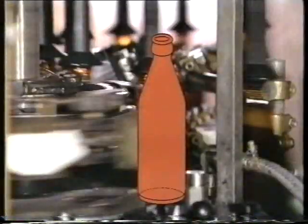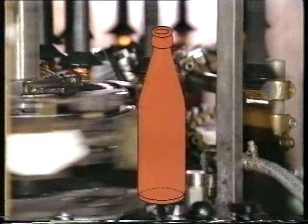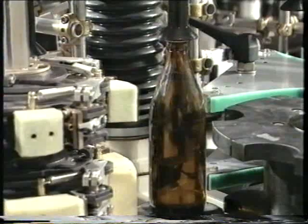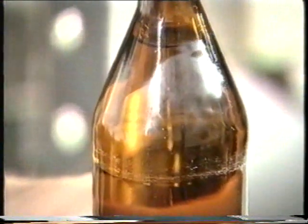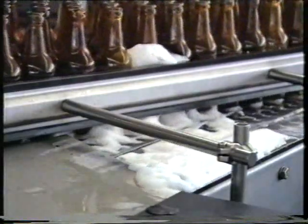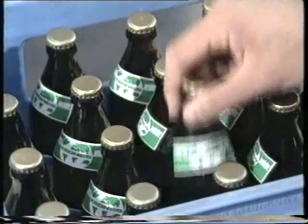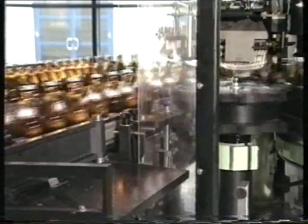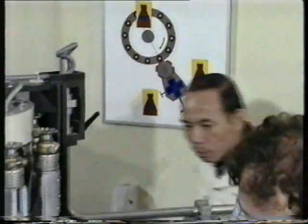Apart from the glue and paper, the bottle material can also be at fault in the case of random erroneous labeling. If the bottles vary in their dimensions such as height, diameter, and shape, a precise centering on the bottle plate is not possible. Too much surface coating — detectable by the bluish glimmer — results in a too-smooth surface on which the glue cannot stick properly, just like contamination from conveyor lubricants or aluminium residues from the bottle washer, resulting in badly sticking labels after drying. We have now covered the most frequently occurring causes of faulty labeling, but we've only touched the tip of the iceberg.